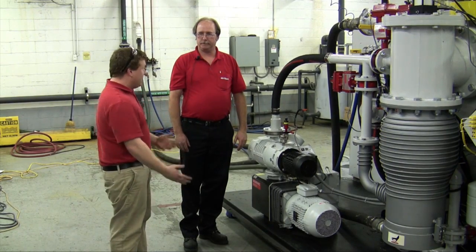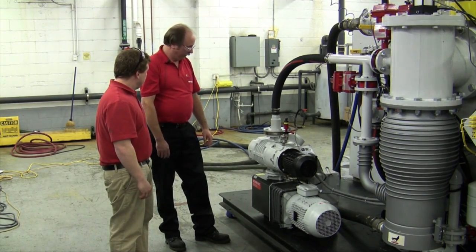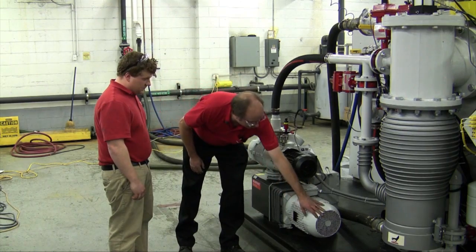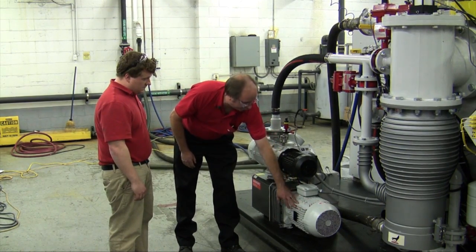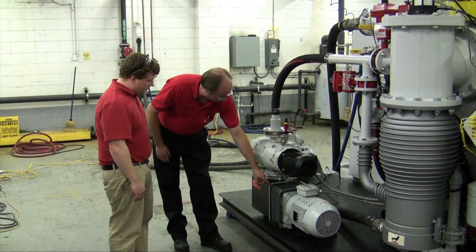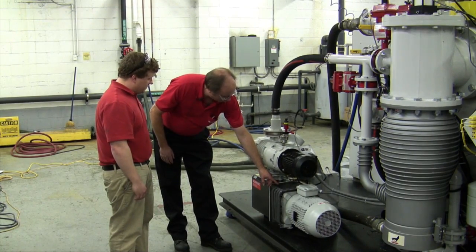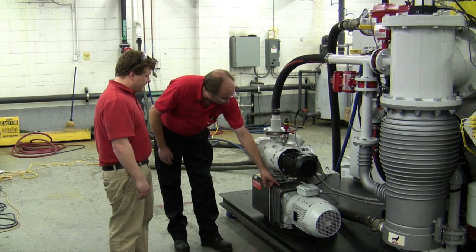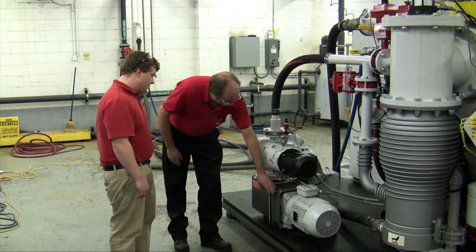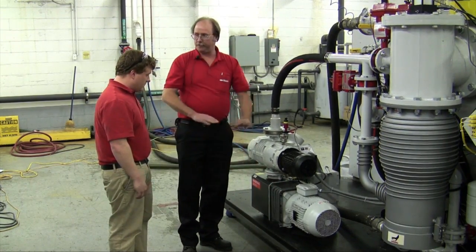Before we turn on the pumps, make sure the whole cooling circuit is clean and free so air flows evenly around the pump. We've already checked one side of the air circuit. Now we want to make sure that the fan and the fan cover are clean on this end — this ensures the motor is clean. Also clean the fins. There are four loops of copper tubing that go around the turbine — that copper tubing is your oil flow, being cooled by the air blowing off the turbine. Make sure this area is clean and free of debris. We can use compressed air, or if need be, remove the cover to get inside and clean more thoroughly. Typically, blowing it out with compressed air is sufficient.